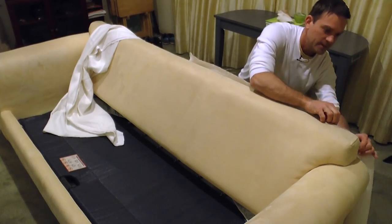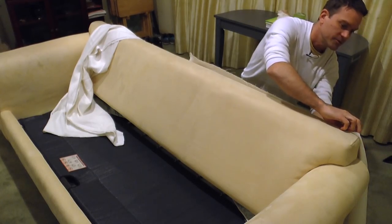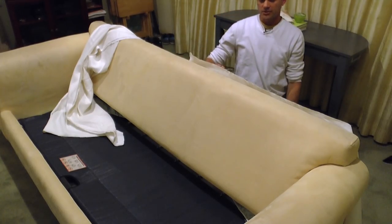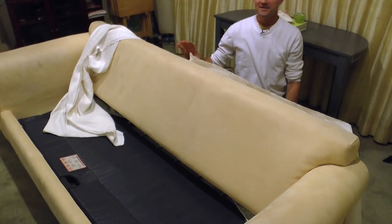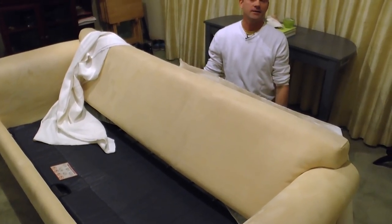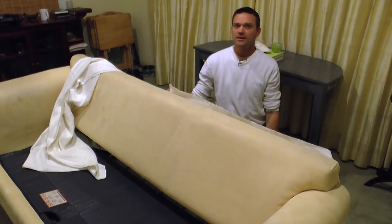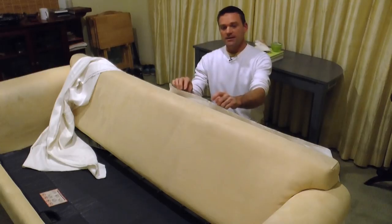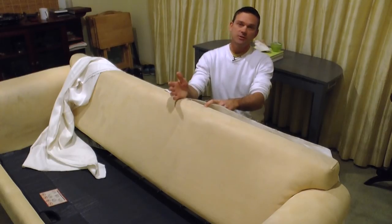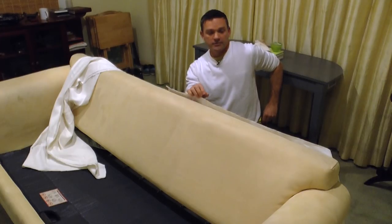Now, sometimes with outside backs, all they did is just lay fabric right across the upholstery. So this is nice. This is done pretty well. But sometimes I'll just put fabric right across it, and there's no foundation at all in the back there. So it's just your top cover. And that can be hard sometimes, keeping anchor pins in. They want to fall out, and you certainly can't pinch it and do the anchoring that I demonstrated here. So just do the best you can. Put as many as you can in there, because we don't want this pattern fabric to move on us.